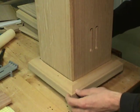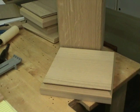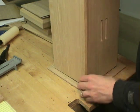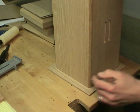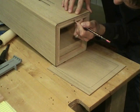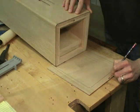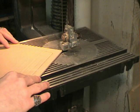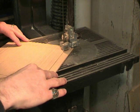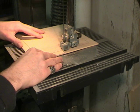You can see that the foot fits loosely around the column, and that's what we're looking for. The piece that goes on top of the foot will be traced to fit the column exactly. I trace each column individually and mark the corresponding pieces and sides that were traced. This is to ensure that we fit the right side to the right column when it all goes back together. At the band saw, I'll cut out the center of this top section of panel material, concentrating on getting as close to the line as possible.